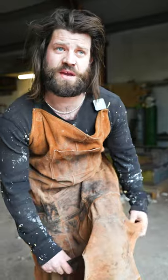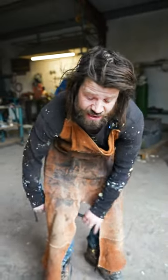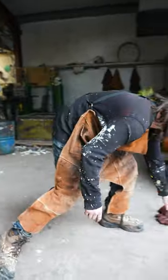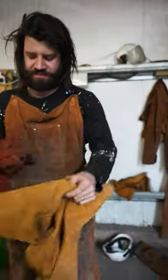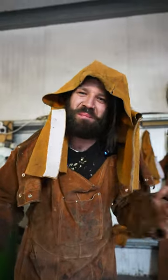In order to be as safe as possible when pouring molten metal, it's a good idea to wear leather aprons or anything heat resistant, because it gets really hot. It doesn't matter what you wear — an old welder's jacket, welding gloves, anything suede, leather, or heat resistant. I'm going to wear this jacket and also this headgear — knights at the round table style. You've got the jacket as well for extra protection. It may not look the prettiest but it keeps me safe.